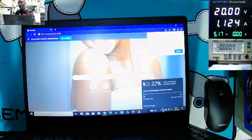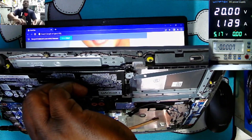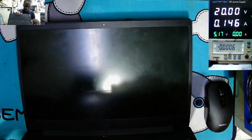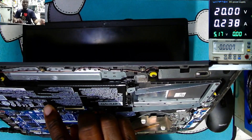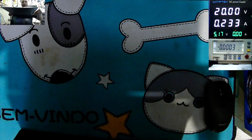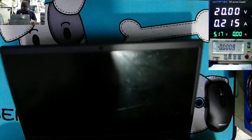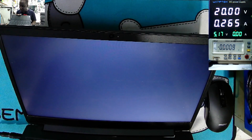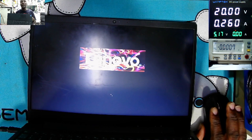That is the reason why I did not even test — I just spotted the problem. Even if I disconnect the battery now, the laptop must still be on because the 19 volts — it must come on. Yes, the battery is disconnected and the laptop is coming on. It's coming on with the battery disconnected. That means the 19-volt power line is now present. The charging port is doing some funny things, but the laptop comes on without any problem.